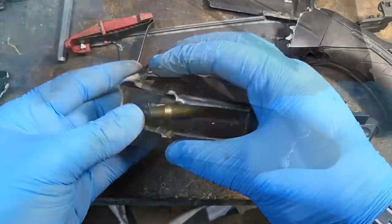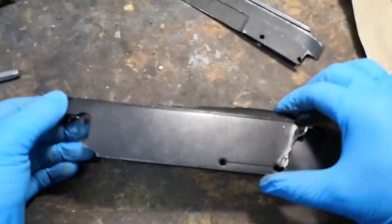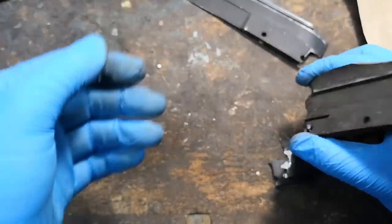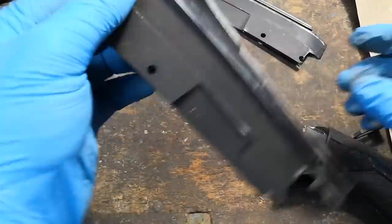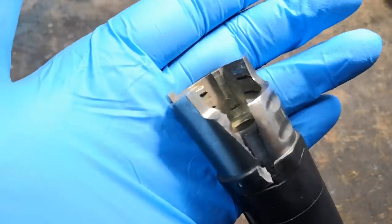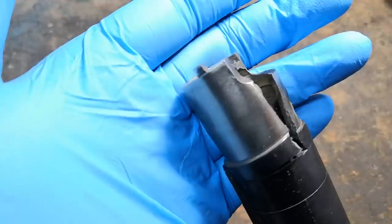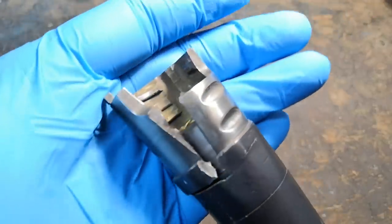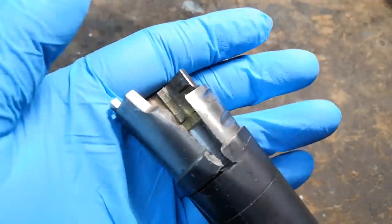And if we look closely, we will see that the damage sustained by the different gun parts shows clear signs of pressure-related failure. The magazine is bulged and the frame plates have been blown outwards. Even the barrel extension tells us it suffered from too much internal pressure — the fracture is longitudinal, so the failure was caused by hoop stresses, not the longitudinally acting forces applied to the locking lugs.